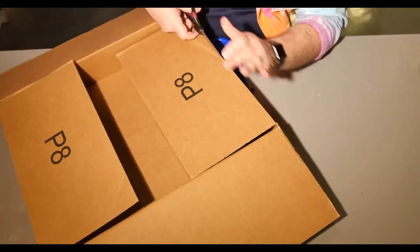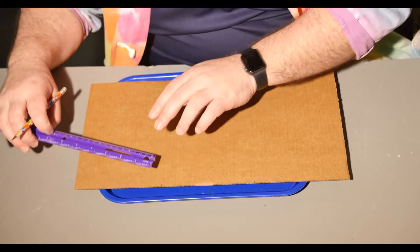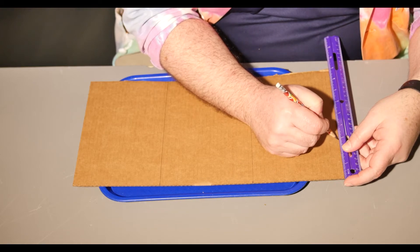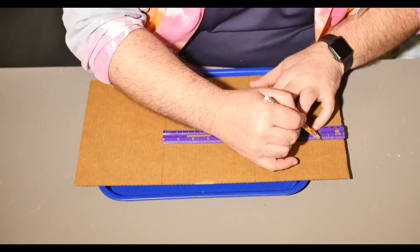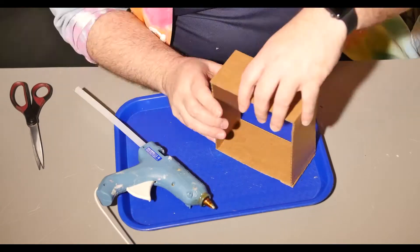If you don't have a small enough box, just go onto Amazon and order something really small — or you can just cut one out of a larger box. Cut the box into more manageable pieces, starting with the flaps. Start at the end of one of the longer two edges, measure 6 inches and make a mark. Keep going until you've run out of space or you have 4 marks. Do the same thing on the opposite edge starting at the same end, then draw a line connecting your marks. Along the shorter edge where you started, measure 3 inches from the corner and make a mark. Repeat this on each of the lines you drew, starting from the same edge, then draw a line connecting your marks. Cut them out and repeat to get four 6 inch by 3 inch rectangles. To make the frame, hot glue the short ends together to make a square. Your frame is done!